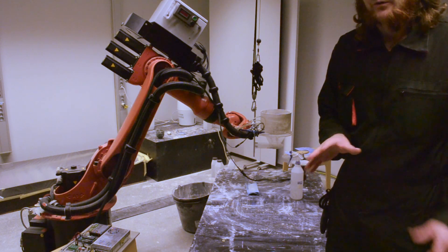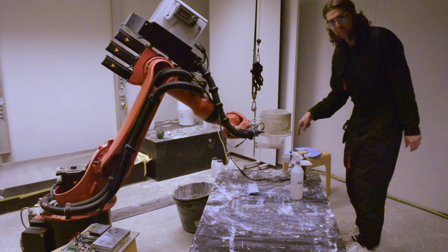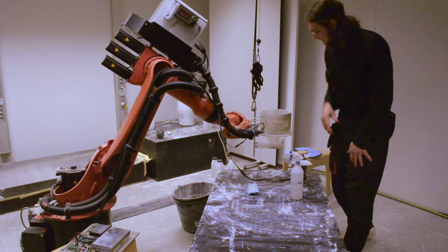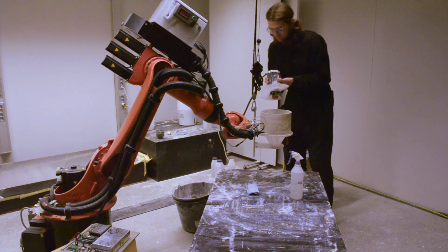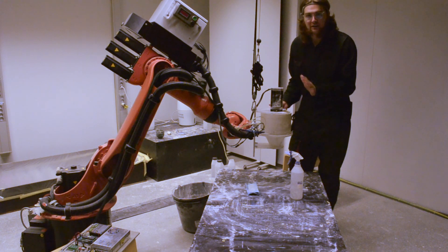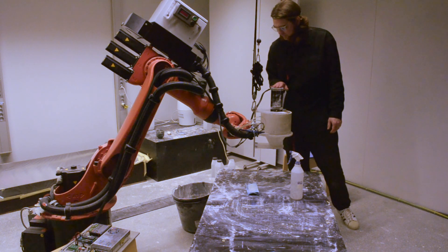Let's reposition the view. Before we maneuver with the machine, we of course want to first make sure that the situation does not impose any risk of colliding with or damaging anything. Since this stepper motor is connected via cable here, before moving the head we want to make sure that this does not risk damaging the cable. For this demonstration we will do very gentle moves with no risk of tipping anything over. It has quite a mass itself, so it will balance alright. Now this cable and stepper motor are not at risk.